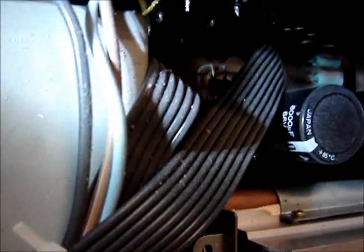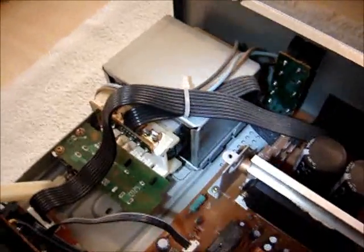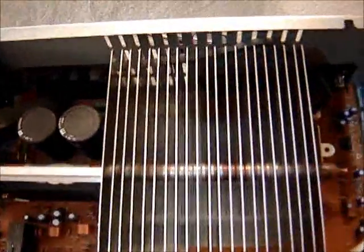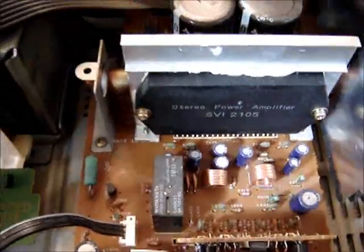It's got 8,000 microfarad capacitors at 66 volts, and a pretty decent-size transformer - it's kind of flattened down so it fits in the case, almost a square shape. I don't know what this thing was rated. I couldn't find anything on eBay or the internet about what power it is. I couldn't find a data sheet, which makes me mad. I don't have the patience to look all over the place, so I'll just have to power test it and see what it can do.